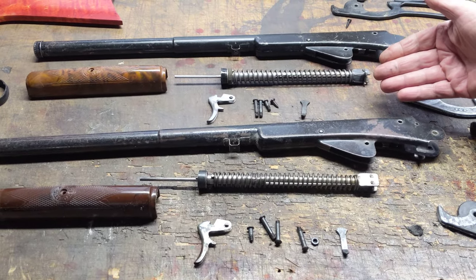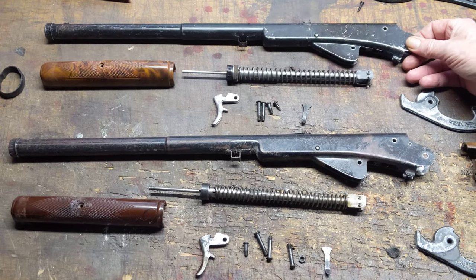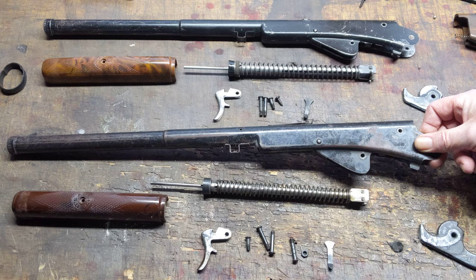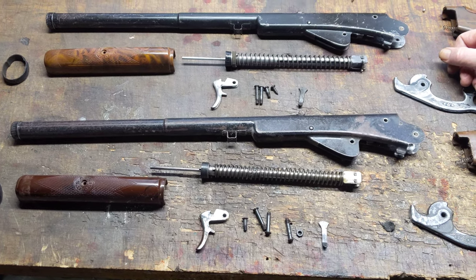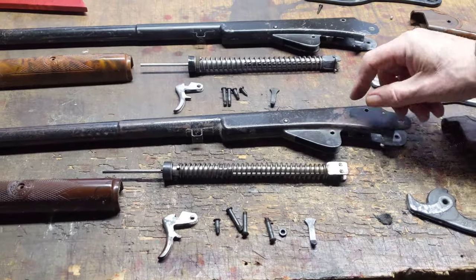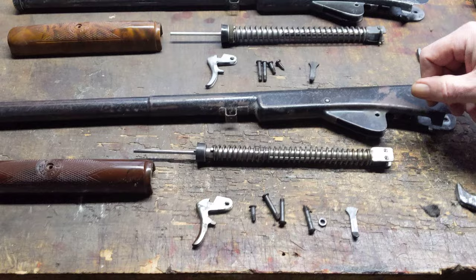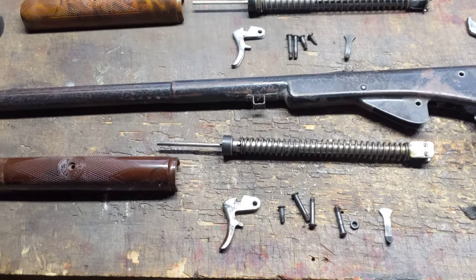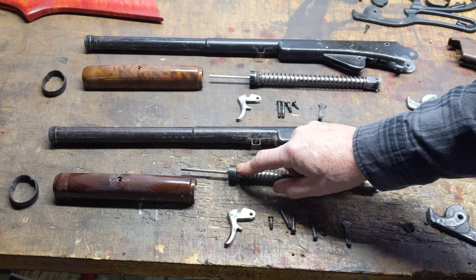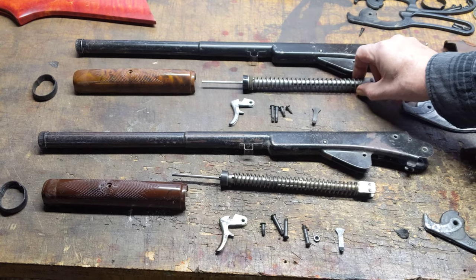It's just an example of manufacturing changing in different environments. When they moved to Rogers, they updated equipment and standardized the receivers — because why would you want to build two of the exact same model guns in two different ways? This would lead to issues down the road. So to summarize: two guns, both Model 75s. Early guns used small seals, later guns used larger seals. Both are still equivalent guns — they both look the same and work the same — but they're internally different. One small difference that makes a big difference. If you try to use a small seal in a large compression chamber, you're not going to get any compression and you're not going to have a gun that works.